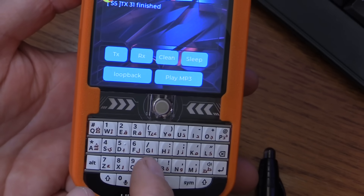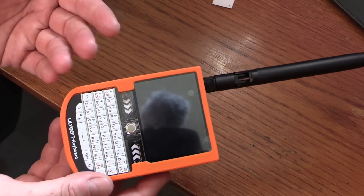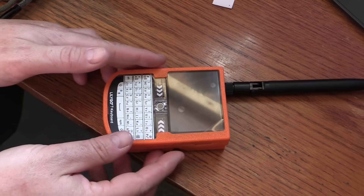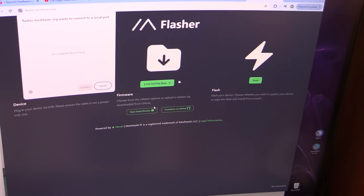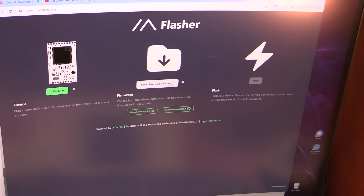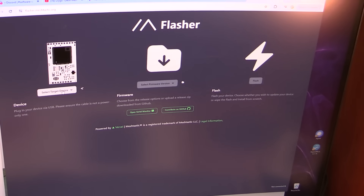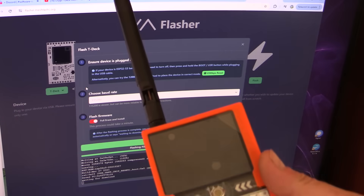I don't quite know what characters these are — they must have gotten these keyboards cheap from some discount place, maybe once a cell phone maker went out of business. The little trackball moves the smiley around the screen. Apparently you can do web browsing, VNC, network analysis, movie player — but we're trying to do Meshtastic. So I'm going to go on the Meshtastic website, specifically flasher.meshtastic.org, select the stable firmware version, and plug the thing in over USB. After a factory restart and some fiddling, now it's working and it says it's complete.